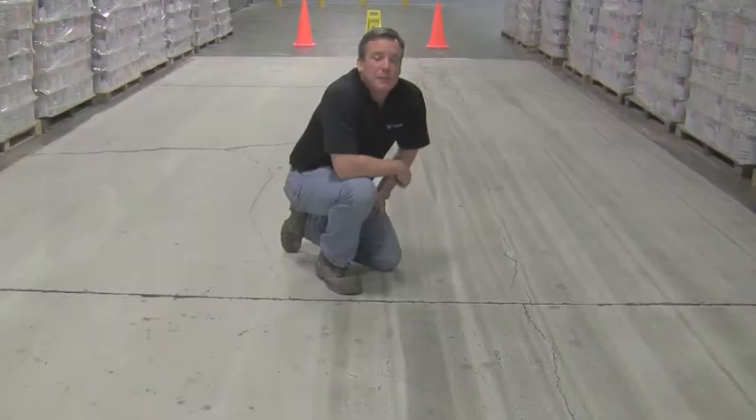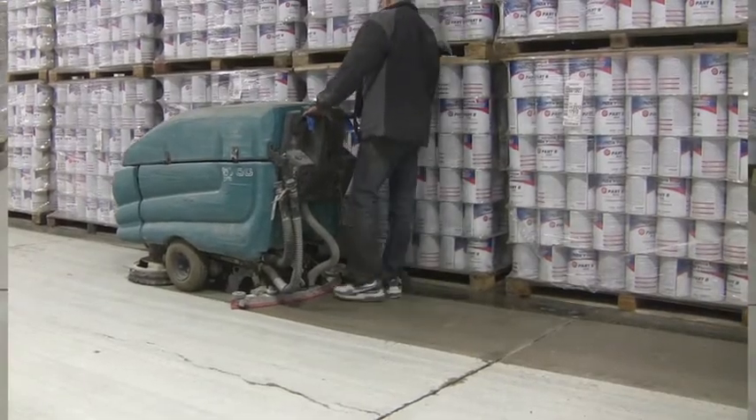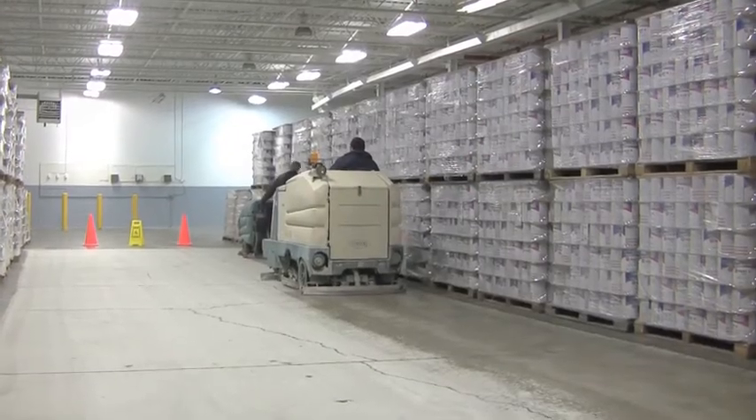On my left we've just completed four passes with a 25 grit metal concrete prep tool. As you can see there are dark lines and spots in the floor that indicate they have not yet been profiled by the tool. Remnants of the yellow line are still present and you can also see large looping scratches that indicate the operator was moving the machine at a pace faster than recommended. Additional slow passes are necessary to ensure these low spots are reached and an even clean white concrete profile is achieved before proceeding with the next step.